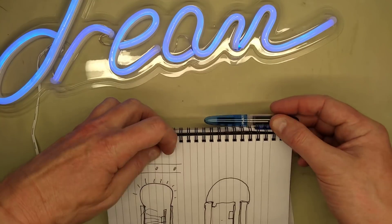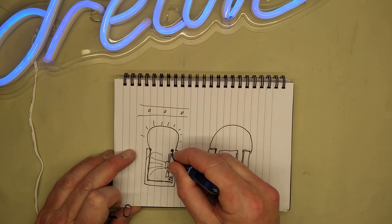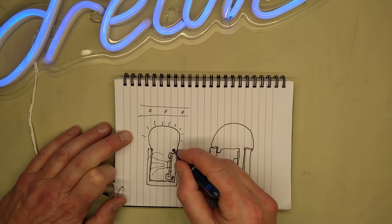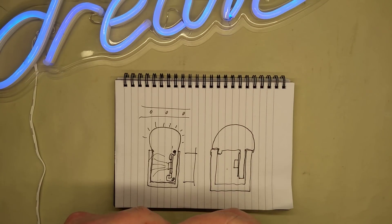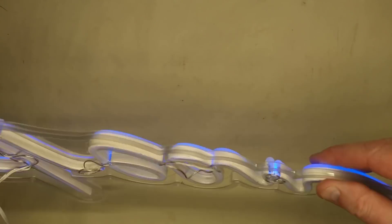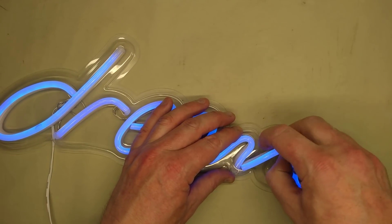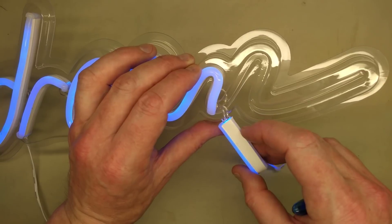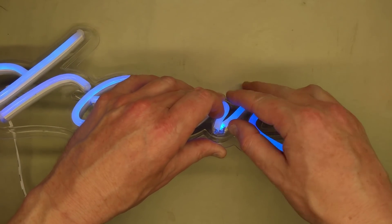I should include the bus bar wires in the picture. The bus bar wires are typically like this, and they occasionally loop down onto the circuit board. The idea is that when you terminate it, you've got little metal spikes that go into the end of those in a connector — they make the connection, and you can also loop out the other end. It just makes it very easy to terminate. In this case they've done it differently — they appear to have soldered directly onto the end of the rope, which is just that little bit messier. They've soldered directly onto the LED tape here, probably because it was easier to solder onto that point than make a connection with the bus bars.